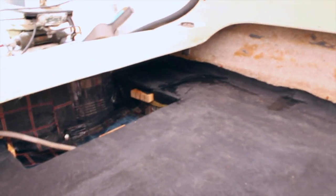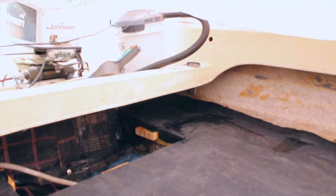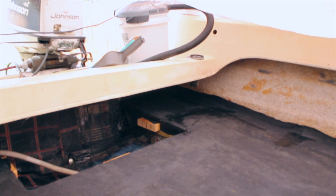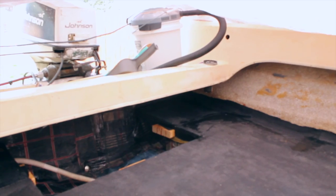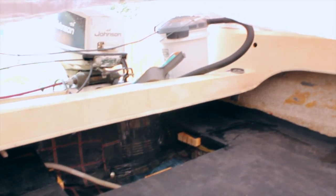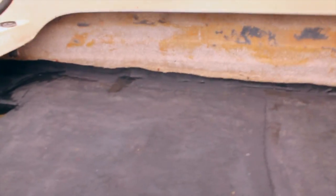Hardest part is getting up under the little corners and getting the chopped strand and fleece blankets to lay up against the wall and pour resin on it, because I really don't have much room. Probably got about 6 inches up under there, maybe less. It was really difficult to do that, so I had to do that on both sides of the bilge as well as up under in the bow area. So after we got all that done, fiberglassed the floors and sections and just worked my way all the way through. I underestimated the total project